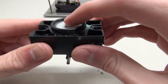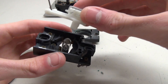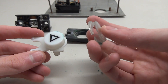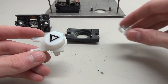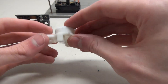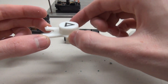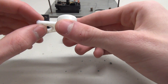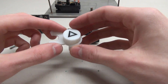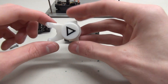There's some blue gunk on here, but the button itself presses down. If you pull this plastic piece off you can actually take out the button. Here we have the actual button itself — it has a little plastic protective cover, which is cracked a bit. There's the arrow with some blue gunk on it. You can see there are two pieces on the bottom which actually press down on the contact. That's kind of why when you press these buttons they press on an angle — it sits on a pivot, and when you press down it presses at an angle, not straight down, which is why it feels easier on one side than the other.